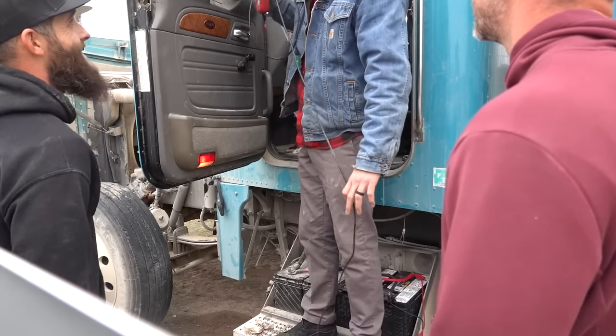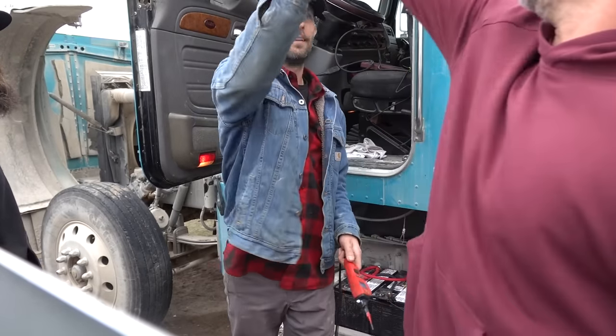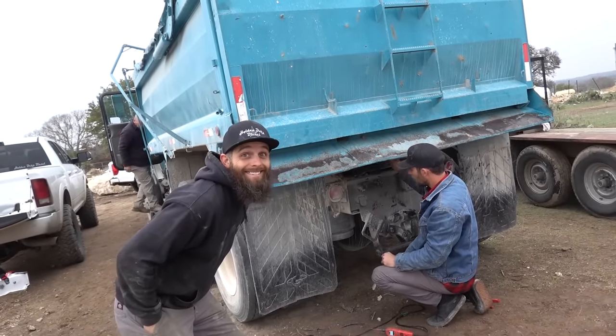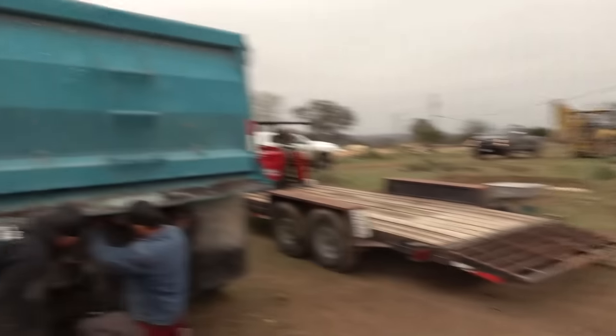Back to the bus bar and the fuse panel. It's a bus to fuse somewhere. It has a messed up wire. I'm so glad we didn't sell your computer. We found out what the problem was. There's a weird little switch back here. It got tripped when we were welding back there. Someone either bumped it or just the welding zapped it. So we just bypassed the switch. Now Optimus is back. Runs just fine. That's all it was. Simple. We thought we were going to have to buy a whole new computer.